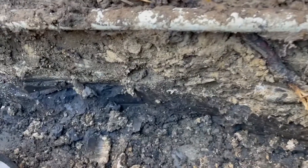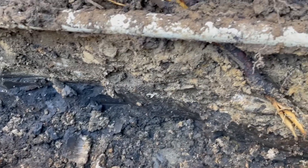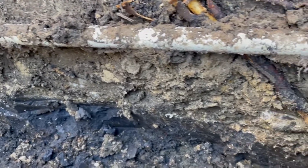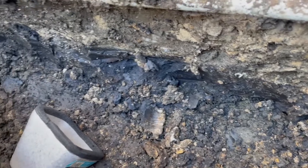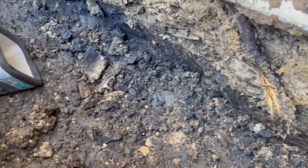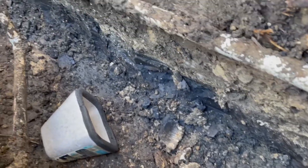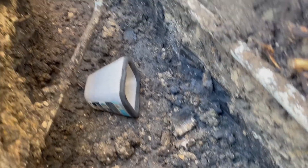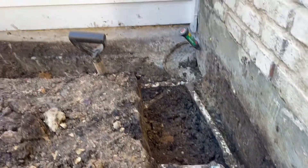I'm just going to show you here — that's the bottom of the foundation where you can see some gray, a lot of brown, light brown, and then when you get to the mud clay, we've reached underneath that. So we're just about three or four inches below — that's perfect. We'll work our grade falling away from there.